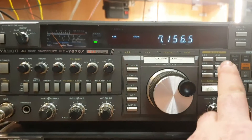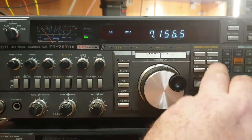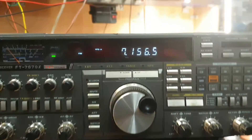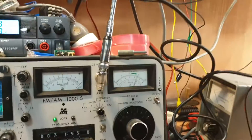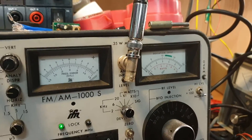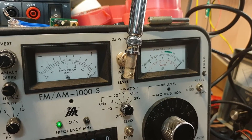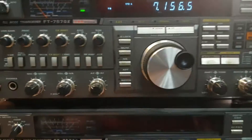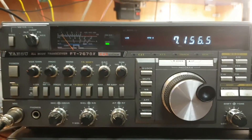For all intents and purposes: all mode — FSK, AM, CW, FM, etc. I just want to check we've got some power on FM. Yeah, we've got 100 watts. That's a good way to see power if you're not good at whistling — just hit FM and there's 100 watts of FM power. The RF stage on this is obviously doing very well.